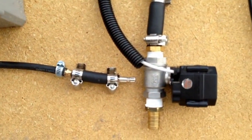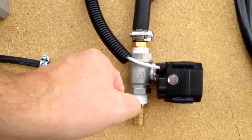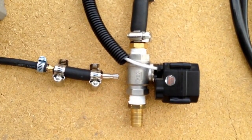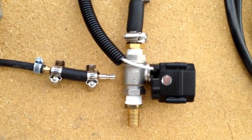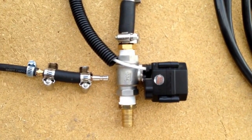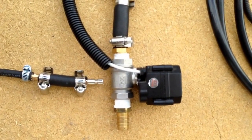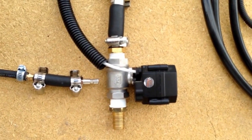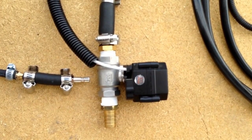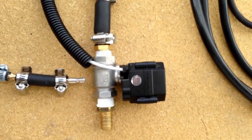Right here is just our automatic on/off ball valve. This is similar to one you would operate by hand, except it's automatic. When the system is on, it will open and let gas flow; when the system is off, it will close. It's specifically designed so that if your engine ever stalls out or you lose power — even if you completely lose power — it will still close and seal off the gas permanently. So it's basically like having a hand-adjustable ball valve, except automatic.